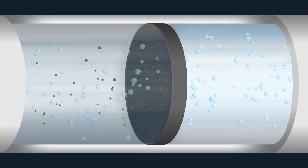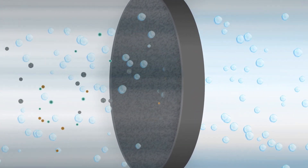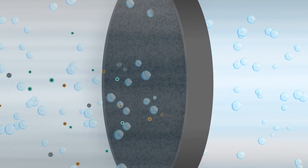There are two different ways to check your membrane operation. One would be to check the output and see how much water it's actually creating. The other would be to check the actual water quality. To check the water quality, we need to check and see how much of the incoming contaminants are being removed with the membrane. The membrane rejects a certain amount of the incoming TDS, or total dissolved solids. We use a TDS meter to measure these readings to let us know what the performance of the membrane is like.